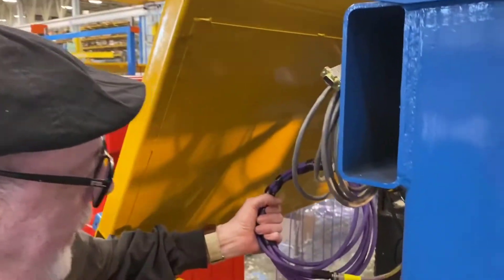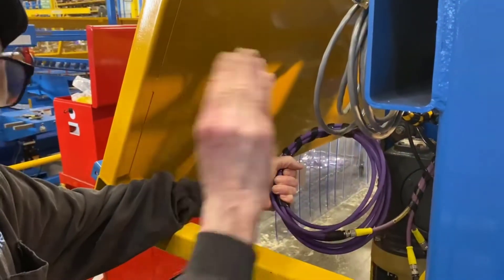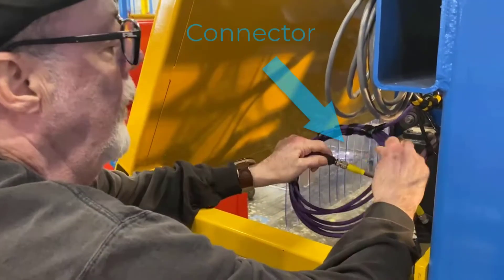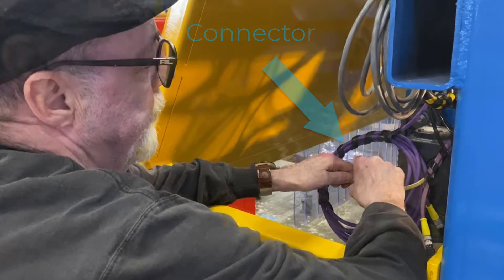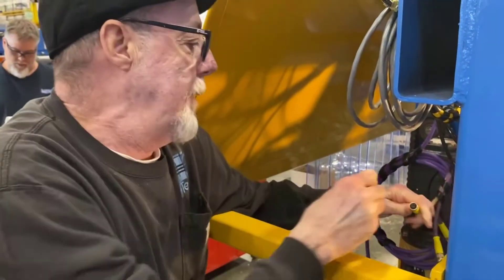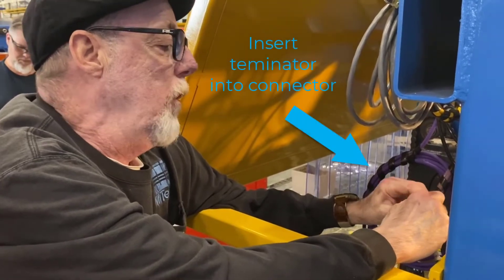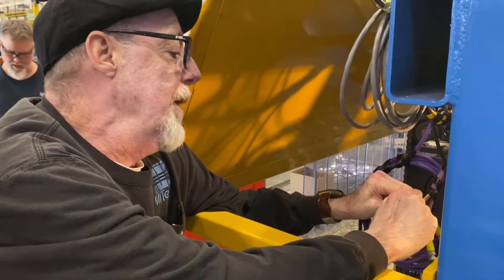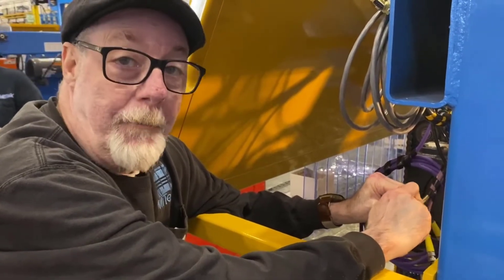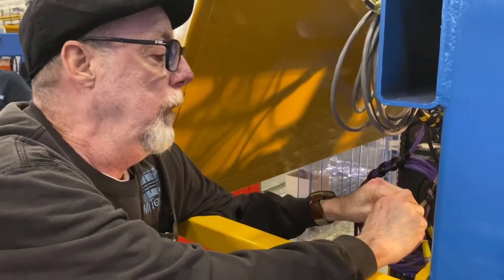You'll see there's a long purple wire that's all coiled up — this is what's feeding the other side of the saw. We're going to unscrew this connector, take the terminator, and put it into here. Simply turn it real slowly and it'll fall right into place. If you're forcing it, you're probably doing something wrong and you're going to damage the pins on the cord itself.